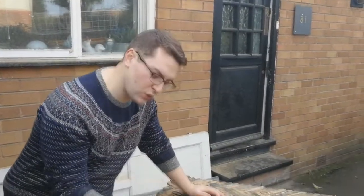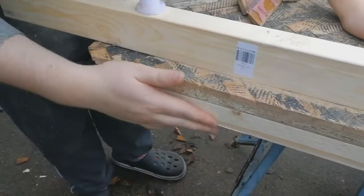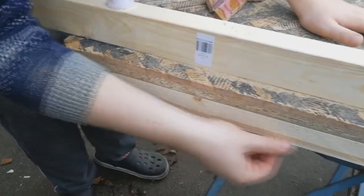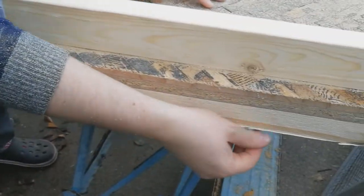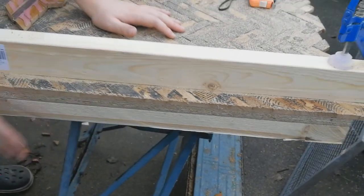I've cut a nice straight line and I'm going to measure in six centimetres — that's my three centimetre margin plus the three centimetres already underneath from before — and that will give me a nice flush cut all the way through the studding, the chipboard and the table. I actually had to take off six and a half centimetres to cut into the studding as well. I've taken off six and a half centimetres all the way around and I'll clean this bit up with a chisel so it's all nice and flat on all sides.